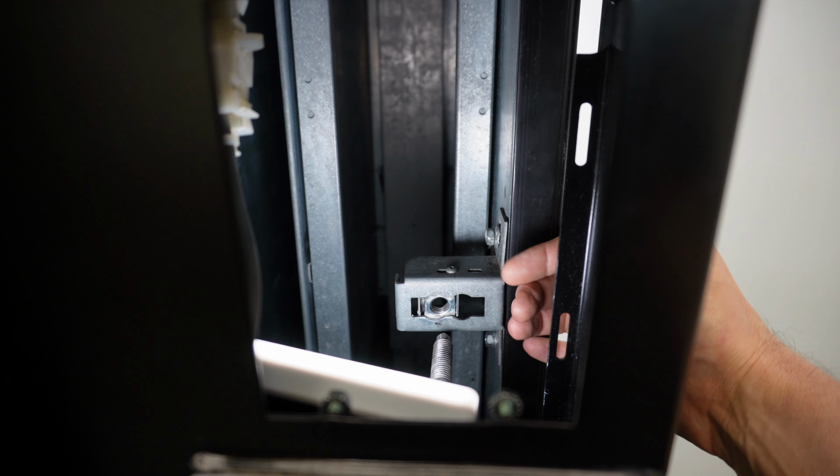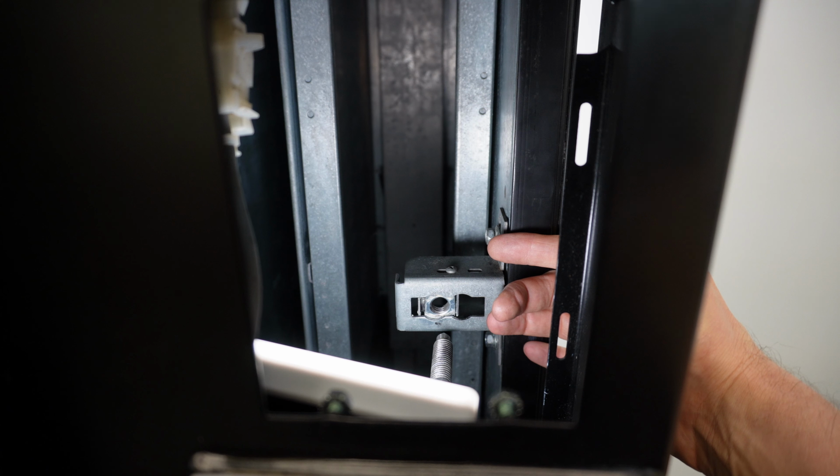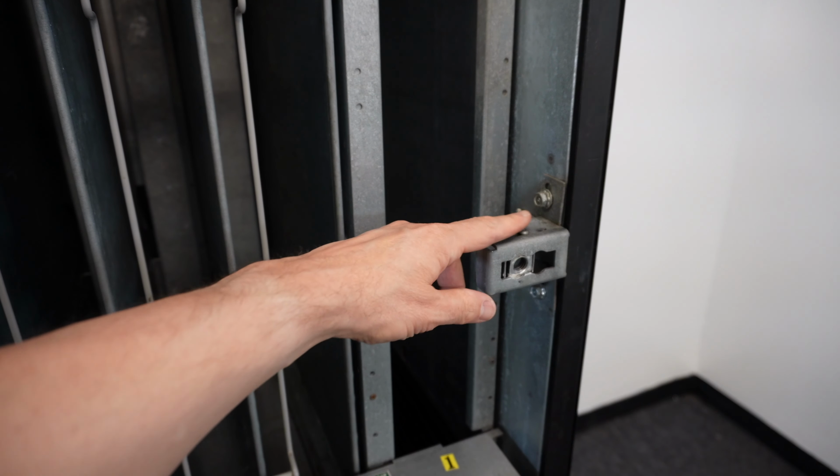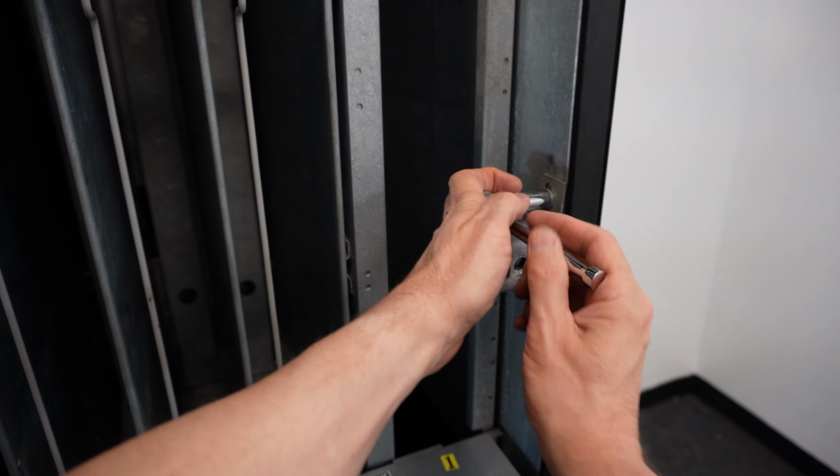Now these are 7/16 bolts on a Dixie Narco 501E. On a Royal or a Vendo, that may be a different size. Again, I'll link above and in the description the video I have about the top 5 tools you want to have on hand whenever servicing your vending machines. I'm going to go ahead and loosen these bolts with that 7/16 socket.